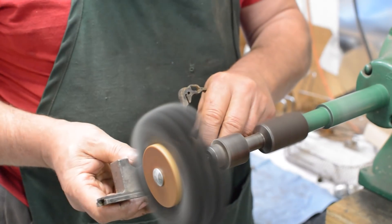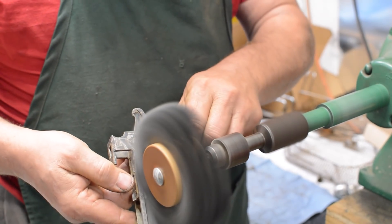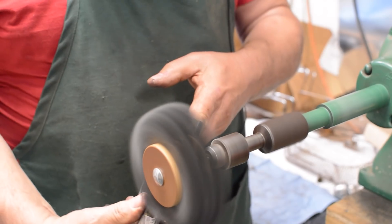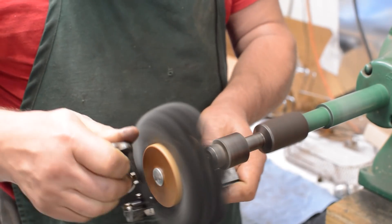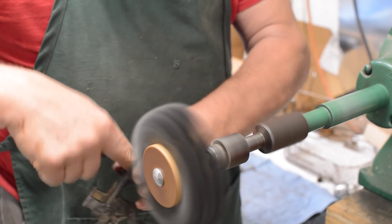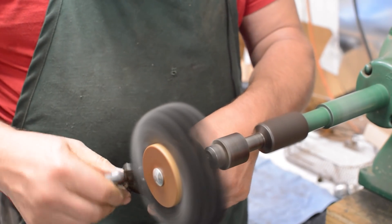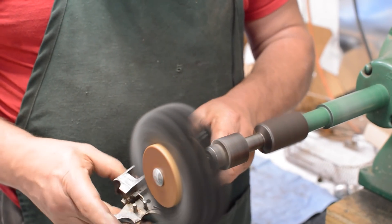We've boiled and now we are carding. This is not a wire wheel — this is a three thousandths wheel. When you boil all the oil off of something, you're left with just the rust in its aftermath. Since we've converted that to an oxide now, it just comes right off. And the stuff that was just flat-out dirt just comes off with it. For getting up inside the nooks and crannies, the toothbrush works really well. This is essentially powered steel wool. The blue stuff stayed blue, but the surface finish on this thing is pretty much wrecked — and it was wrecked by somebody other than us.